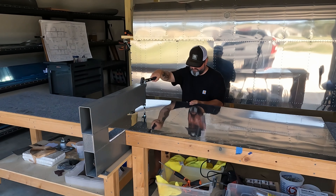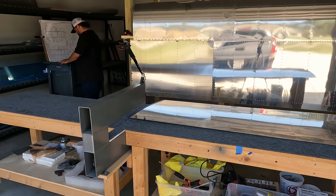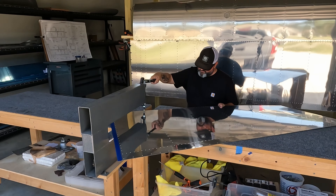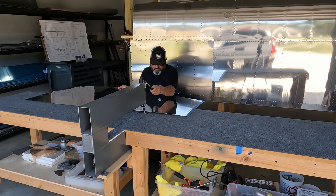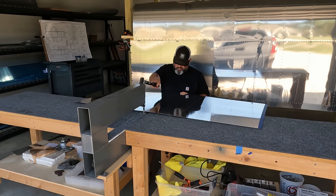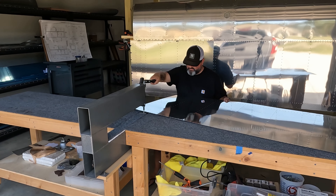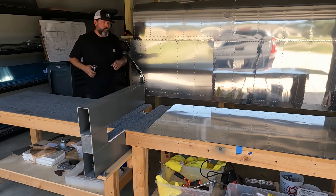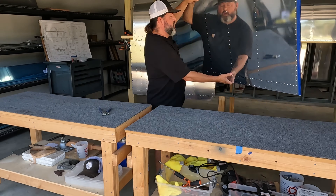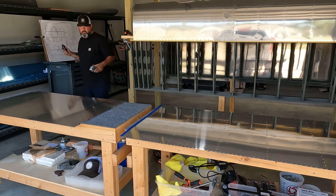There is a lot of work that needs to be done on those dimples because there's a lot of material there. You have the aft spar, and then there are a few sections along that aft spar where there are doublers, and then the skin itself. After you dimple the aft spar to accept the dimple on the skin, you need to - as the plans say - touch up the dimples with a deburring tool or a countersink. I'll use a deburring tool to take just a little bit more material out of there so the dimple on the skin nests in better. The plans do say this is really just a cosmetic thing, not a critical thing, so don't take away too much material.